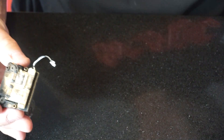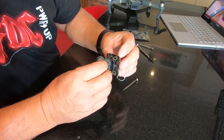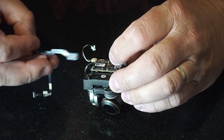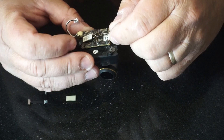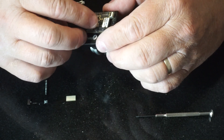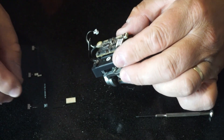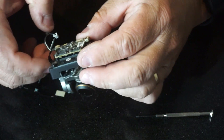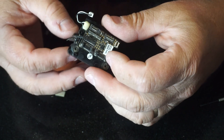There's our gimbal. Now I've got to start removing these tiny tiny screws. This ribbon cable — starts there — so I guess we pop him off here. I can see the damage to the ribbon cable already. That means we might have a potential fix here. That is the melted bit right there, it's all charcoaly — and that's where my puff of smoke would have come out from.